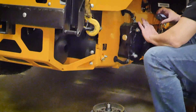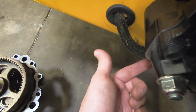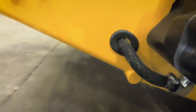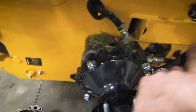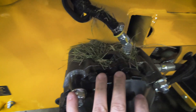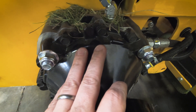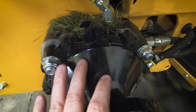The wheel motor also holds about two quarts of oil, and we actually flow oil through the system. Here we have the high-pressure lines going to the pump to power it; on the bottom we have a hose that feeds the oil filter, which you can see right under there, and that feeds into the pump's charge system. The dump comes back here, and then we have a hose that goes up to the reservoir. So we're holding about two quarts of oil in here, and that helps extend the life of the system and gives us more cooling and more exposure on these parts.